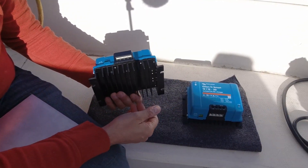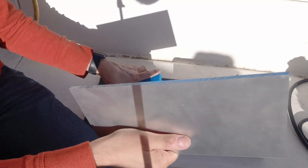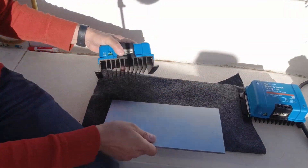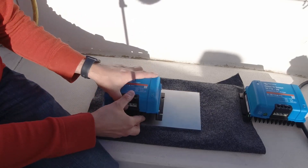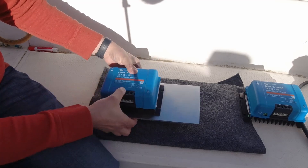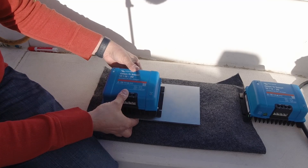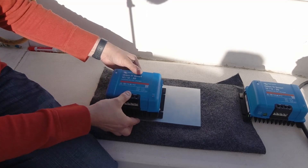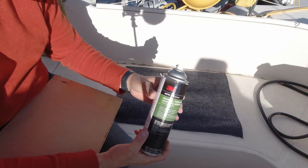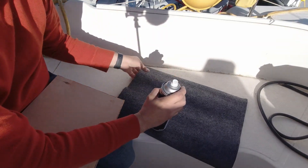These units get kind of hot, and it's much better if you can mount directly to a vehicle chassis - which we don't have. So I bought this quarter-inch aluminum plate as an excellent heat sink to help them out. I'm going to mount the aluminum plate on the board and then the Orions to the aluminum plate, spacing the aluminum plates out a bit to allow more airflow. This is the 3M general adhesive for automotive, so it should withstand our heat.